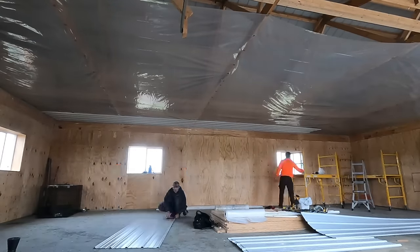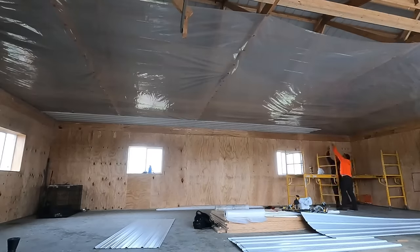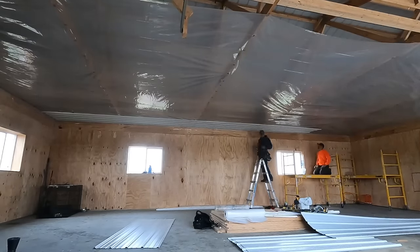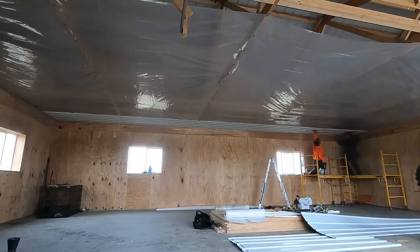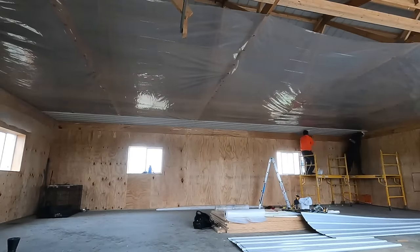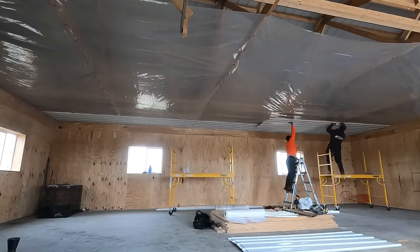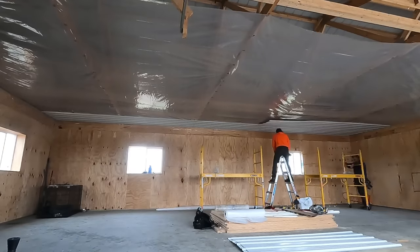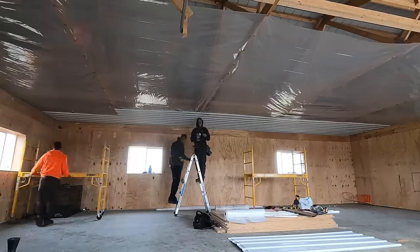Ran steel panels across the top to finish it off. And ideally, in my opinion, you want 2 to 6 inches of overlap on your panels. So you just gotta measure, make sure you measure each set of bays. I think 16 foot is a nice size panel for two people to put up. If you get much bigger than that, it gets pretty difficult. But it goes pretty smooth. About 4 to 6 inches overlap would be good.